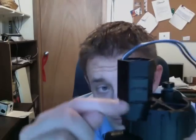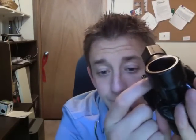Other than that, you got to visually inspect everything. When you take apart a valve and you're not careful, I was mentioning that O-ring before, it'll be leaking right here. And you want to make sure that it's not leaking underneath the jar top. You might be saying to me, well, Dan, I just flushed it out. How am I going to tell if there's a leak with all the water inside the valve box? I don't have a good answer to that, so you might have to go grab a towel and dry it off or something like that.